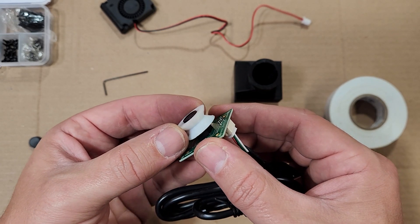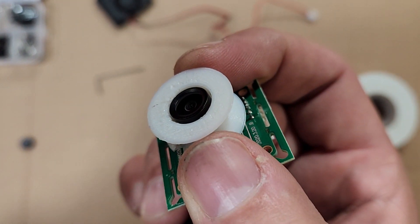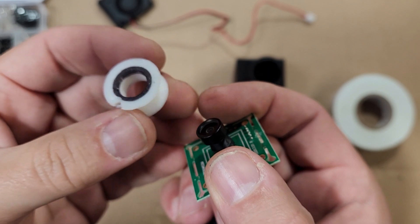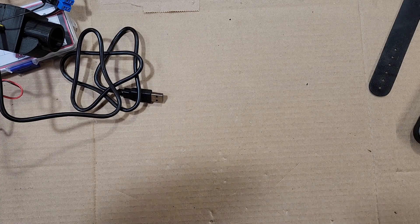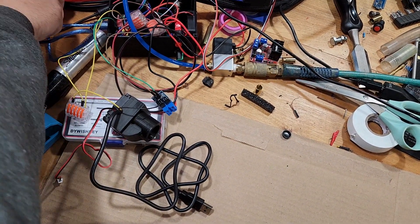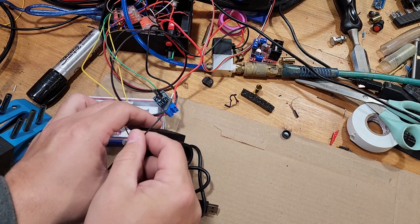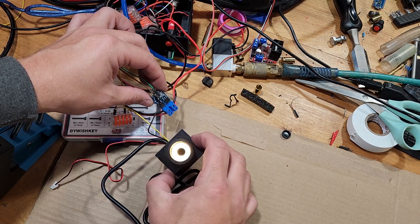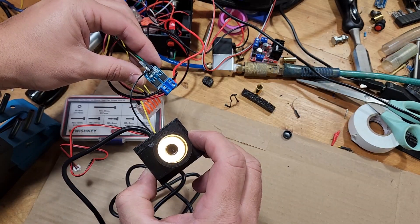If you recall I mentioned we were going to talk about that black mark on the light ring — well, this is that time. Because it's a 100-degree lens, the camera can protrude above the light ring and will pick it up. If you run into that situation where you just can't seat the light ring any deeper, what you can do is paint it — use a Sharpie and put a ring around the edge, which will eliminate that problem. Finally, we need to test that the light ring is working. I connected it to a 5-volt power source to evaluate the light ring — my ground wire slipped off briefly, but I just want to make sure the light ring is actually lighting up. We're going to use a PWM motor dimmer to dim this later, but for now we just want to make sure everything is working.